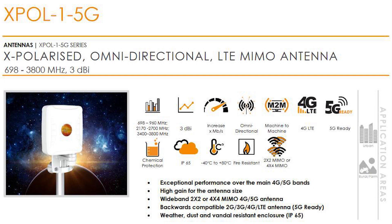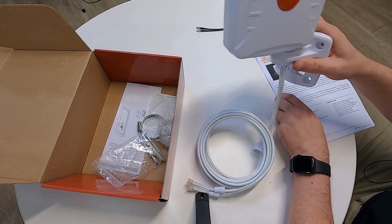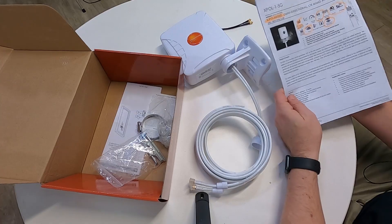This thing being cross polarized really gives you the edge in terms of MIMO performance for a small Omni like this, which I think is going to be super important. The frequency band — 698 to 3,800 MHz — gives you Band 28, so the lowest frequency band we need for 4G in Australia, up to 3.8 GHz making it 5G ready. So if you get this antenna it will be functional anywhere in this country. It's an Omni 4G 5G ready. IP65 rated — so if this thing is upright it can withstand a storm or two — it'll be fine.